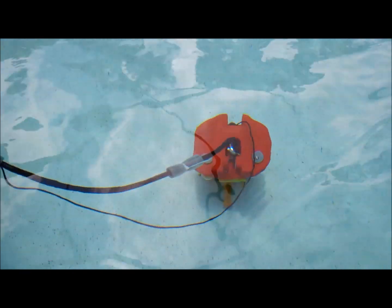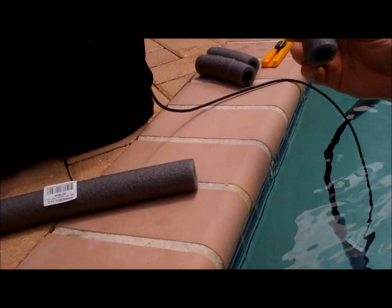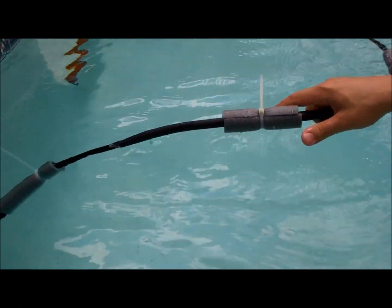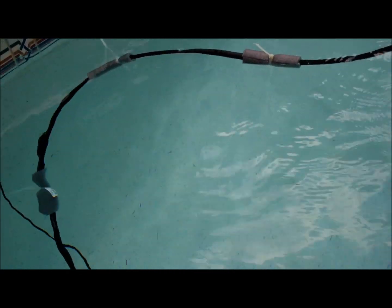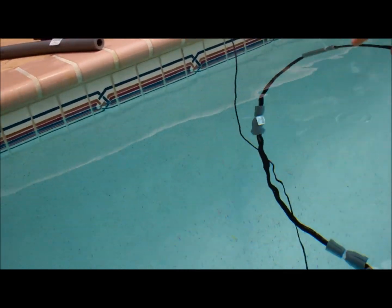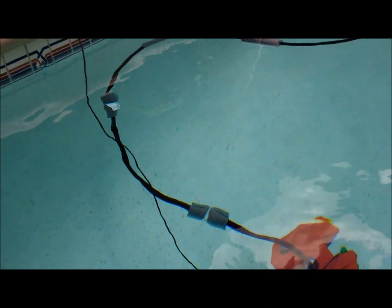We have dropped our little ROV in the swimming pool and you can see it settled nicely on the bottom. What I've done is taken some foam pipe insulation, cut it into little five-inch strips, and used zap straps to secure them to the hose. It has nice friction so these don't move around, but you can slip them by hand to adjust. The idea is to make the tether as neutrally buoyant as possible so that it's not affecting the positive or negative buoyancy of the ROV. You can see the tether for the video camera running to the unit separately — in actual operation it would all be tethered together and held in place with those zap straps.